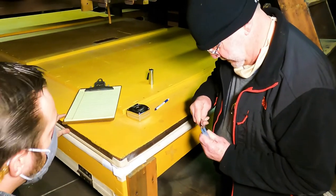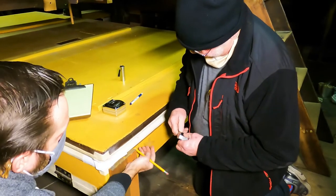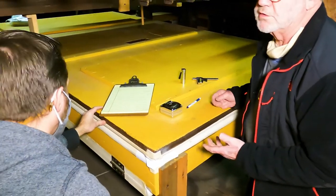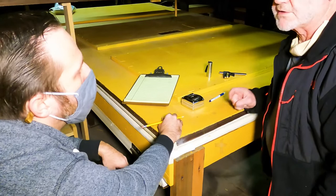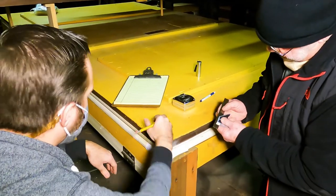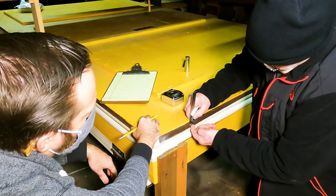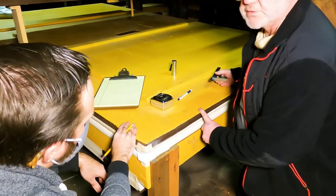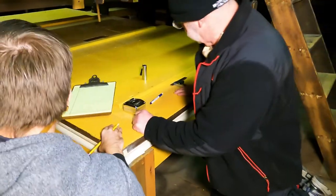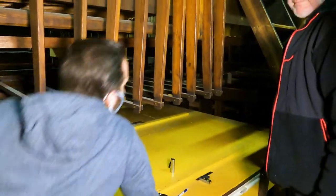What I normally do is take a piece of paper and put it at that spot, lay it over, have it fit all the contours, and then mark it. Is that acceptable practice? Yeah, that's what I do when we put it back in. I'll lay a cut piece on there and put reference marks, and then set it for whatever the line location is. You run along with a pencil. That gives you a reference, and the top part you cover with tape, so that when you're sizing and gluing, it keeps it from making a mess. It's two different approaches, and the same solution.